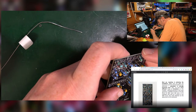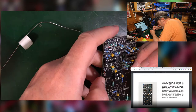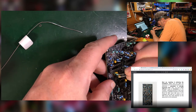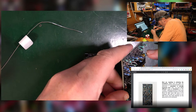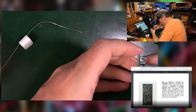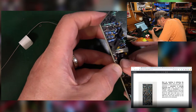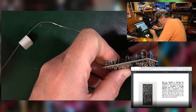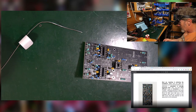So over here, I've got the 54. So that's the JFET. Where does the JFET go? Down here. So it's going to stick the middle leg out a bit forward. You've got to remember to get the orientation right. So on the screen print, you've got the flat bit, and you've got the flat bit of the what's it. So this is the JFET one, the J113, which is here. That one, squeeze that in.